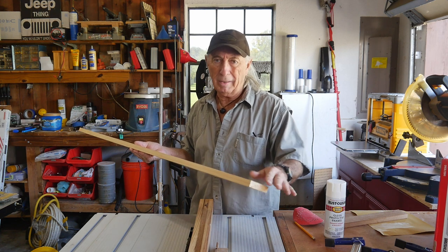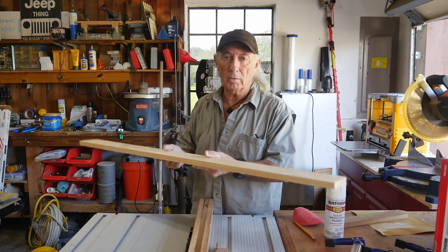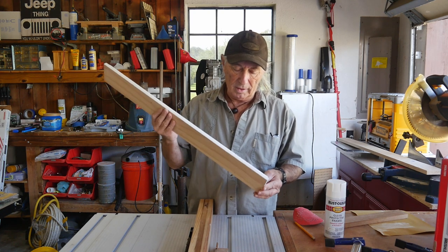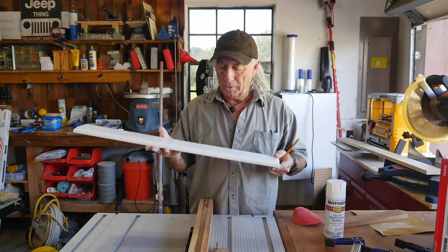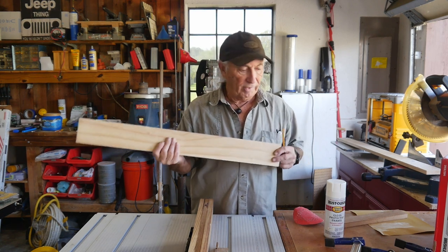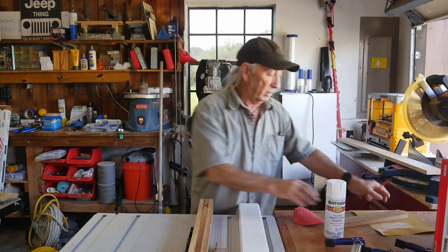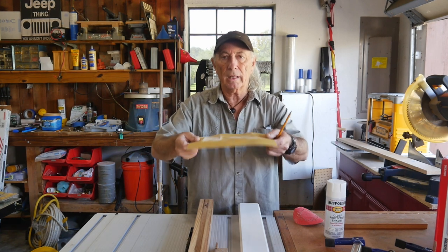This particular project calls for a 30-inch plank. I'm going to cut this with the chop saw first on one end just to square it up, run up my 30 inches, and then cut with my miter saw again — that way we have a 30-inch plank. Here's what to look for: after you get this piece cut and you're ready to router and do all the other little funky stuff with it, you want to take a look at the board on a flat surface and see which way it's curved. It's going to be curved — sometimes very slightly, sometimes it'll be really bowed. What you're looking for is something bowed like this, because when you pull it down with the screws it's going to pull it flat and it'll stay flat for years to come.